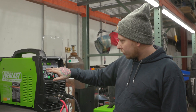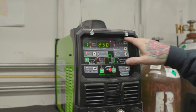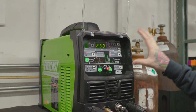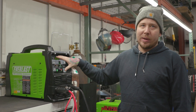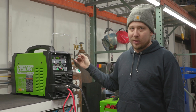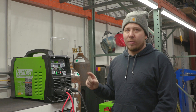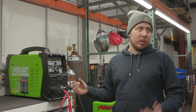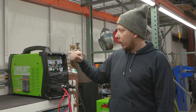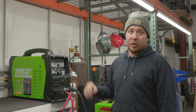This machine actually has 10 memory settings, so you can have 10 different settings stored in it. I like a little bit faster pulse than Dalton does, so I can have a setting for me for when I'm welding rear ends, and Dalton can have a setting for when he's welding. It also handles different components — there are a lot of different settings we like for frequency, balance, and all that depending on what you're welding in the realm of aluminum. So this makes it really quick: oh, I'm going to weld an intercooler — that's on two; I'm welding an intercooler pipe — that's on three. Just a lot easier to move through.